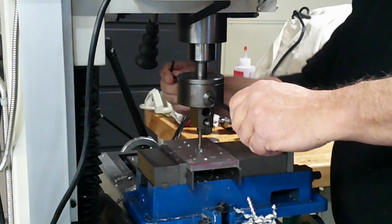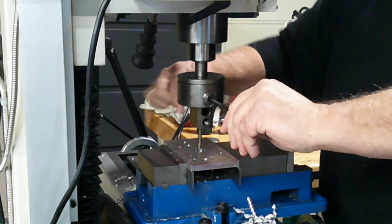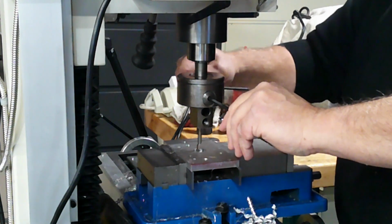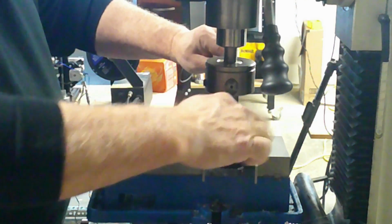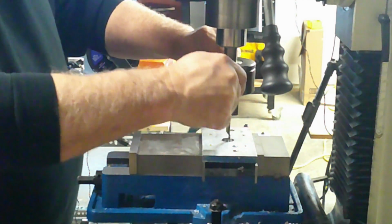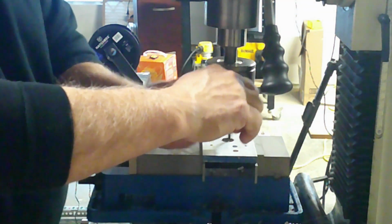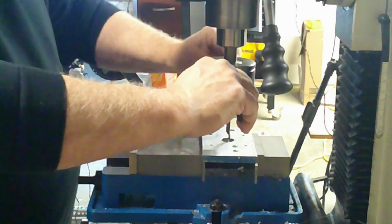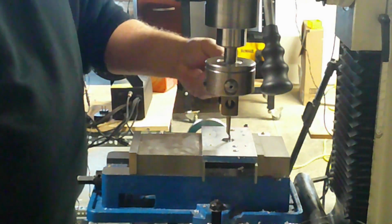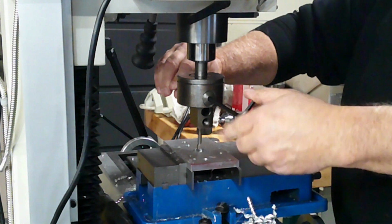As the dial screw is adjusted, the cutting bits are moved further out, creating a larger cut. Once the dial screw has been adjusted to give a proper cut, a set screw is generally used to prevent any additional movement of the cutting head. The third basic part is the boring tool. Boring tools can be mounted vertically or horizontally in many boring head designs. The cutting tool is usually a single point made of M2 or M3 high-speed steel.